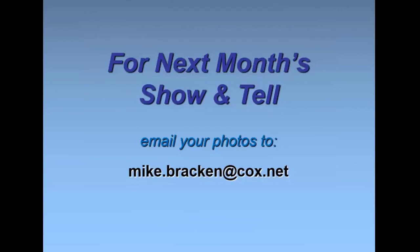That wraps us up — looks like we were up to 35 folks on and about 36 slides. Next week we'll have the general meeting and demonstration, same time, 9 o'clock start, and Ron will be on. Any questions? On using pipe threads: if you re-tap it and run the thread all the way down further than the die, you can make a machine thread out of it — take the taper out. That works great with brass and it's fabulous.